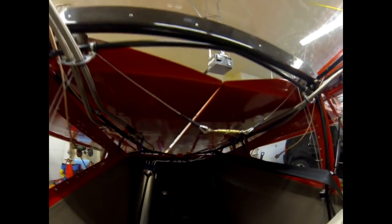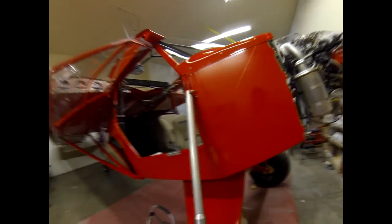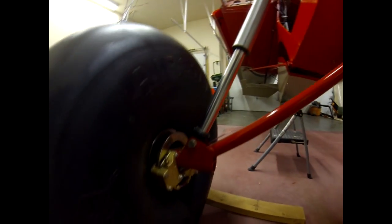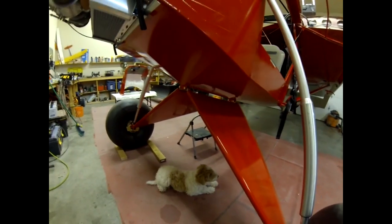I run the coax lines and antennas in the back. You can see how the flaps come together and how the cables go slack when you fold the wing. Up front, here's how the gear is set up — nothing too special, dual caliper brakes and the attach points. There's an AD on the links in the back; I questioned the factory on that but never got a response by email, so I've got to give them a call.